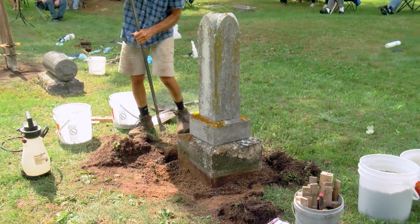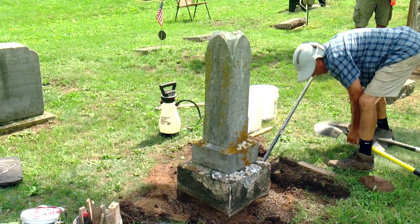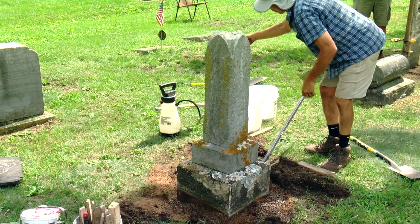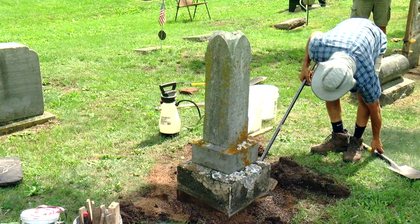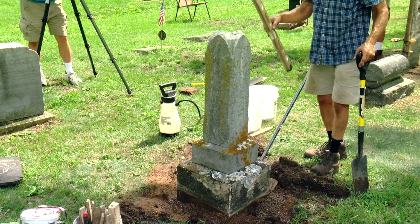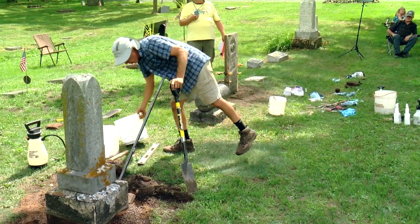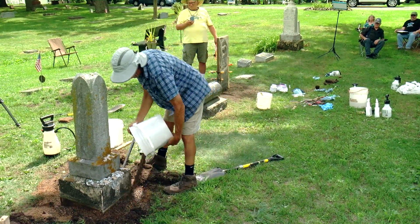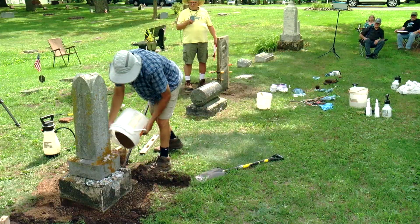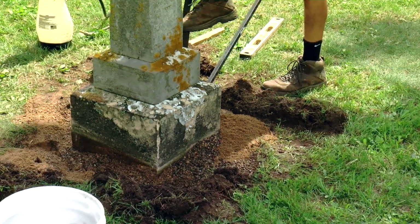Okay, come over here. I'm going to put the bar over here now. Now I'm going to bring the block, the bucket, and shovel out of the way. Don't really need that one anymore now. Throw that with it. Okay, come here with this, and I'll grab the level. So now we're going to be on this side, and the idea is to plumb this so we can see it needs about that much. Okay, let me just get a little more of this here, as we'll use it up. Okay, now we'll do this one, this side. Do the same technique.